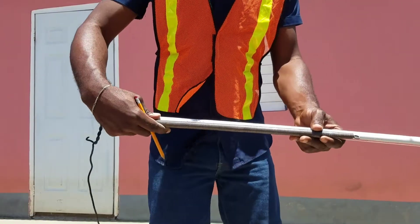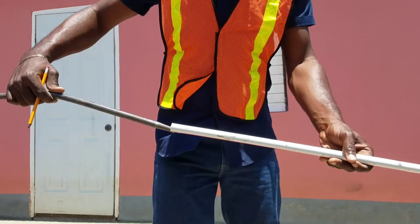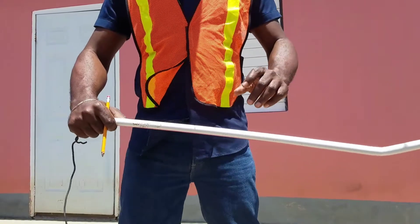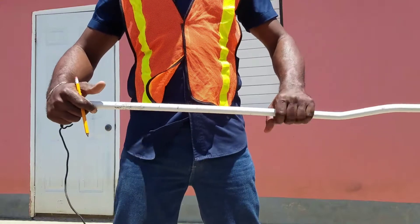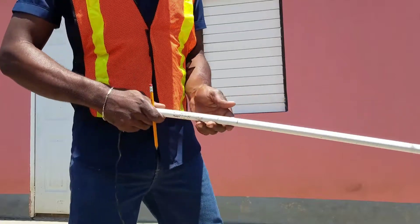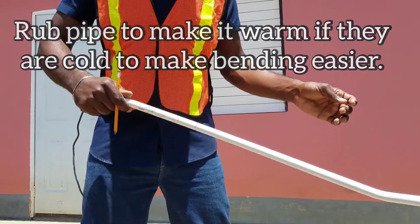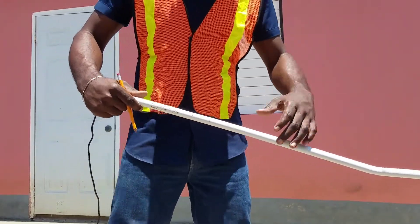We measure to confirm our spring bender will cover this area, then go ahead and insert it. Also, there are times when your pipe might be cold — for instance, in the early morning when you start to work and the pipes are cold, it can be difficult to bend. So you just want to rub it like this to get it warm, because when it is warm it is easier to bend.